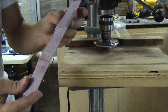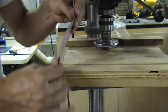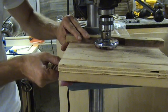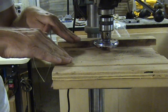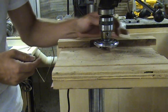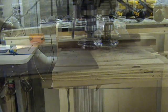I also place a quarter sheet of sandpaper folded in half under the leading edge of the auxiliary table that I have just made. When feeding the lumber into the tool, the tool will only be cutting on the leading edge. There will be a slight gap on the back side between the tool and the lumber. This will keep the safety planer from heating up as much.